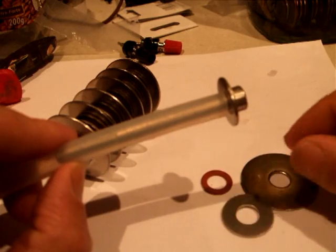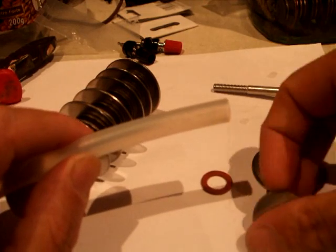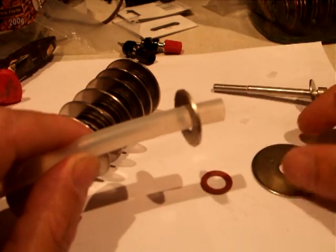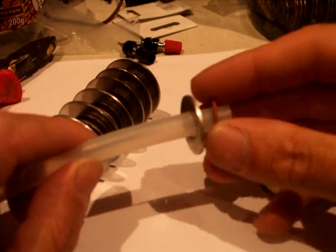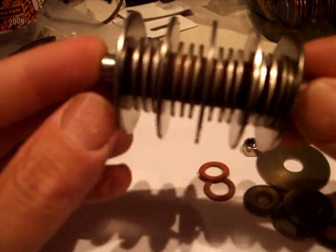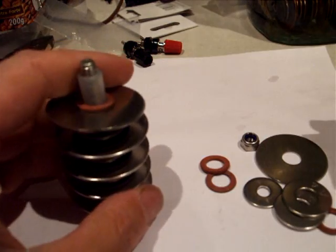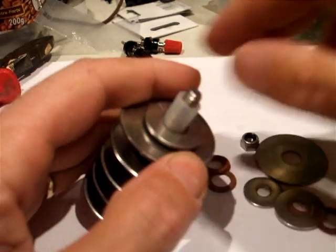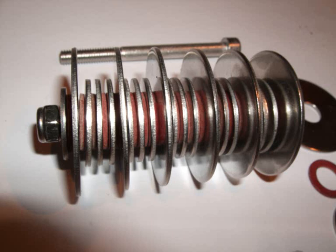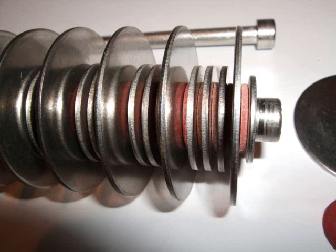That's a 10x40mm stainless steel A4 and that also is a 10x25mm. They all fit over the sleeving quite easily. Some of the fibre washers I've found were a little bit tight but they do go on. Once the cell is tightened up and the soldered cable is wrapped around the plastic centre sleeve there, and you tighten it up, then you'll get a good connection against the washer. This is the side view of the washer so you get a good idea of how I've constructed them. You can see there's three small washers in between two larger washers in each of the segments, and a fibre washer.